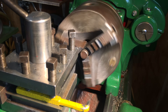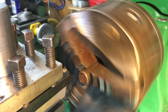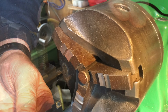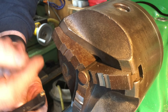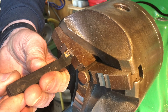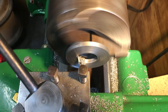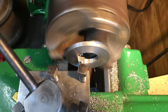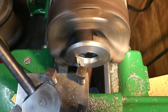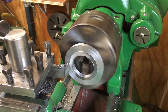I had to clean up another step in these soft jaws because I needed a bit more room behind each washer for the thread cutting operation. I also dug in with the cutter so that each jaw would bite on the OD nearer the middle of each washer rather than on the corner edge — using the insert tool gave me the required undercut to do this. After facing all the smaller bore washers to 6mm thick, this last one was faced off then opened up to around 1 and 13/16 of an inch, that's about 45 and a half millimeters, then turned round and finished to 6mm thick.